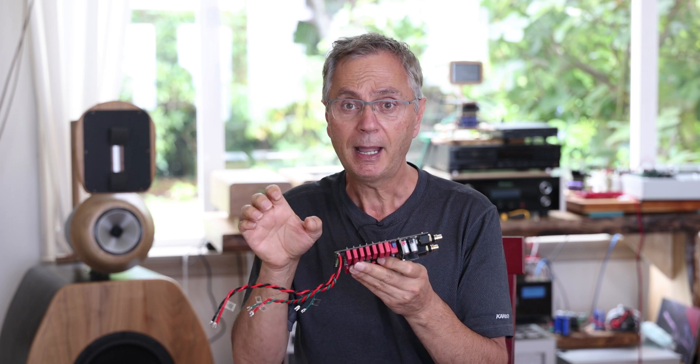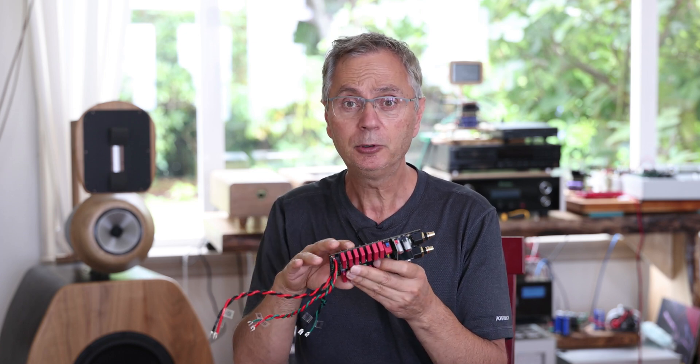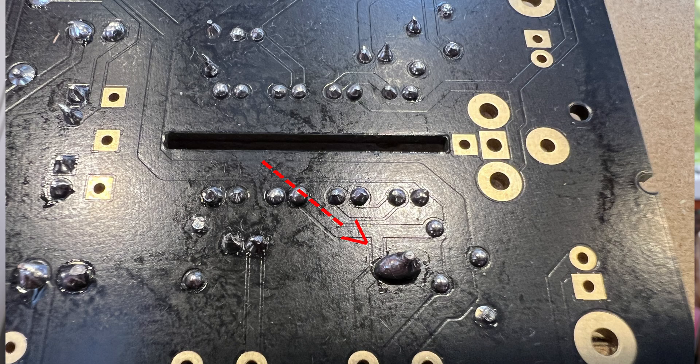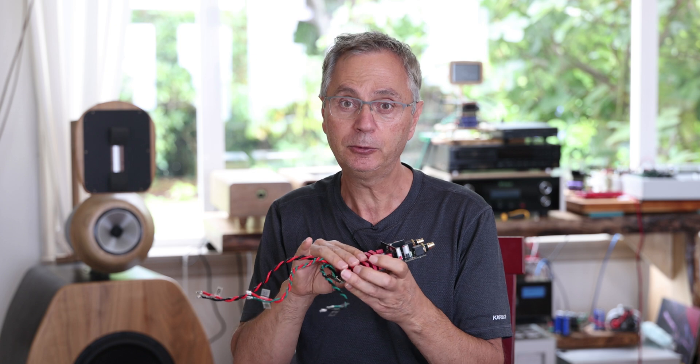For example, while building a couple of these boards myself and routinely checking, I happened to notice I had shorted one of the 10µF capacitors — which automatically means you've shorted your 5-volt power supply. I made sure I fixed it before powering.